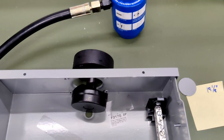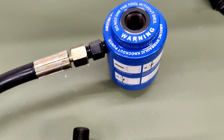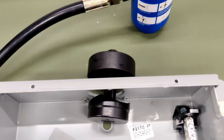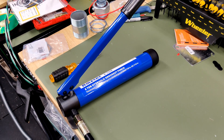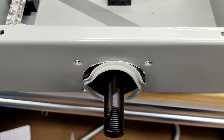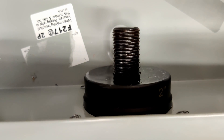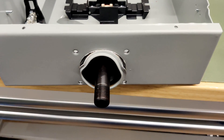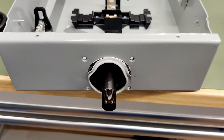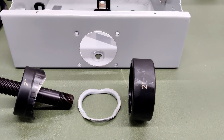It uses metal dies to enlarge the hole with the hydraulic cylinder, using the cutting teeth of the die and a hydraulic hand pump. I learned an important thing about this tool: it has a limited stroke, and the short side goes in the tool while the long side goes in the die. I figured this out after I got part way through and had to unscrew the tool and flip it around to continue. So learn from my mistakes — don't make the same ones I do. Now we have a bigger hole.